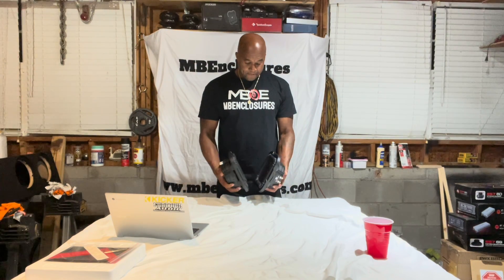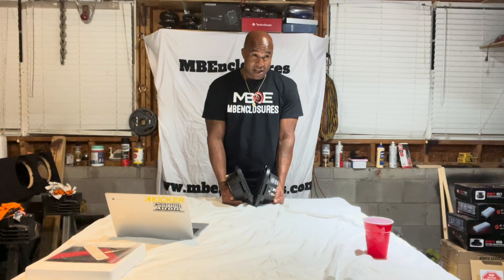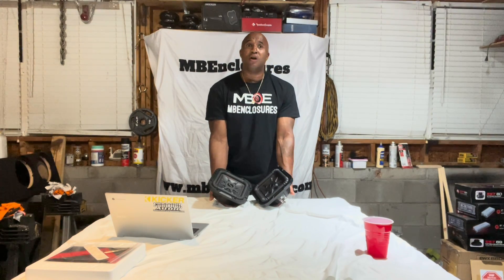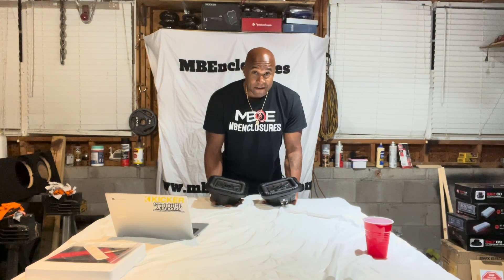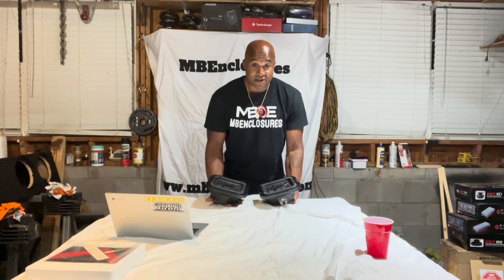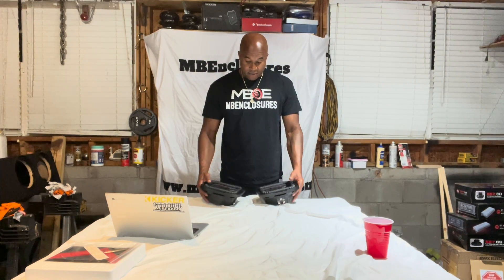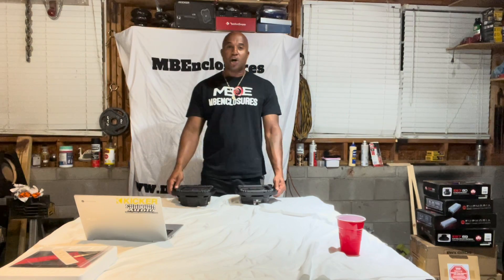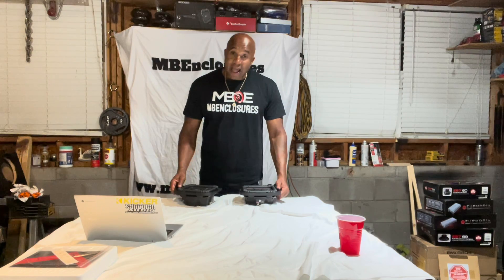I always used a piece of wood in between, back in the 90s. I built this with two JBL 12s — I used to have four JBL 12s — and they needed a relatively large box, like three and a half to four cubes per pair. I wanted to put four of them inside an Escort GT, so what I did was isobaric-load four of them into two pairs — clamshells. I kept a piece of wood in between because I needed the surrounds not impacting each other, and also I wanted to keep the moving mass down. When you couple clamshell drivers, there are different ways to isobaric-load. The clamshell is what we're going to talk about here.